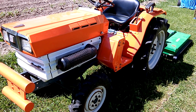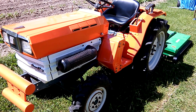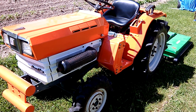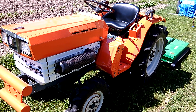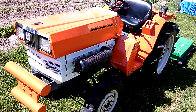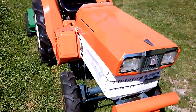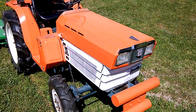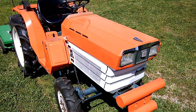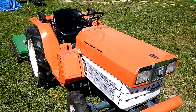I took all the panels off — very easy to unbolt, really easy piece of equipment to work on. All the panels came off, I ground all the rust off with a drill and a grinder, rust-proofed it all, primed it, and then painted it in Kubota orange. It cost me about 20 quid for the paint and 10 pounds for the rust-proofing stuff — so about 30 quid all in, plus a bit of labour. It should be good for another few years.